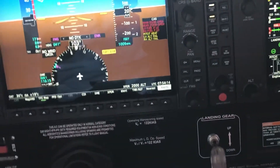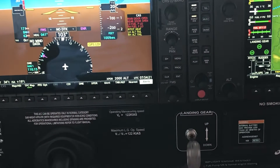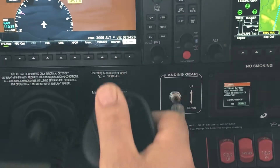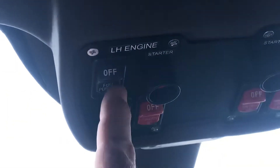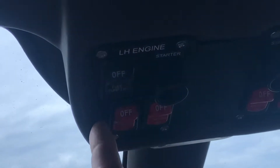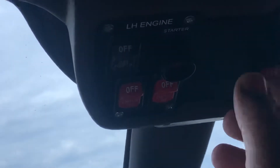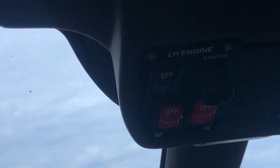In case of emergency, these two units are powered directly from the battery. Here we have the starter for the left engine and right engine. We have fuel pumps — we can put the fuel pump on but there is no fuel, so do not use it. Right-hand fuel pump. Ignition left-hand and right-hand — this is the magneto switching for the magnetos. And here we have the selector bars for fuel selection.